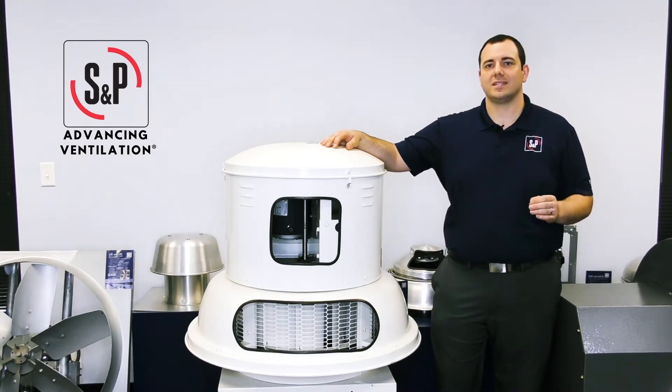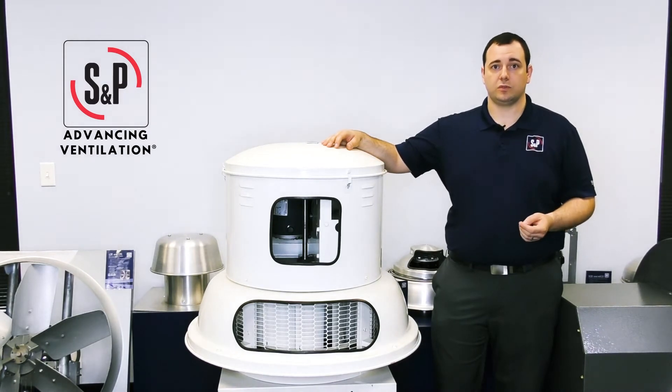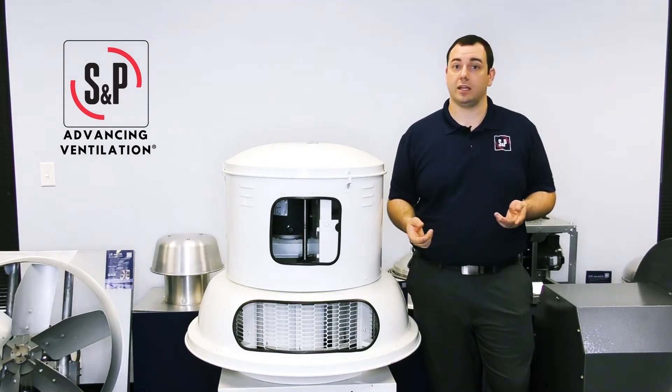L50 is commonly known as the average bearing life, and that is when 50% of the bearings should fail. Historically, L50 was used for bearing ratings, but recently L10, or 10% failure, has been replacing the classic L50 rating.